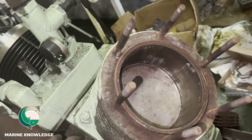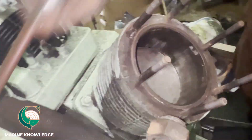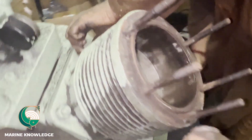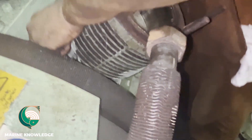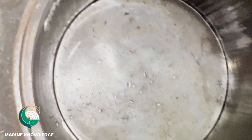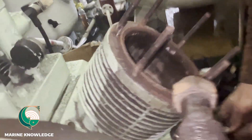At least I have the opportunity to show how to remove the liner, how to change the piston, how to change the connecting rod bearing, and more. Don't forget to follow all the videos related to this compressor so you get a continuation of how to do the job. The cylinder liner part has four nuts — open all four nuts. Once you open them, keep the nuts safely and always do the job carefully so that you don't end up with an injury. You can see the liner condition — it is totally damaged with a lot of scoring marks. Some piston ring must have been damaged and it created all those scratch marks.